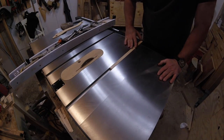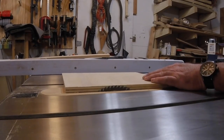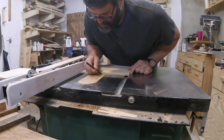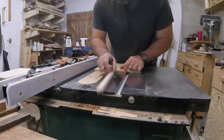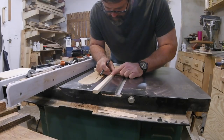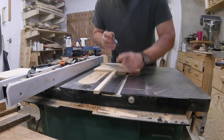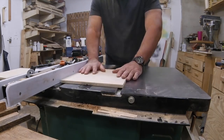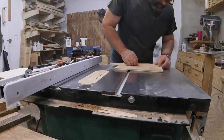For jigs that only use one runner, this is the way to go. I don't want to go to the trouble of setting up a dado blade just for one cut, so I'm going to use the blade I've got in the saw, which is a seven and a quarter inch plywood blade. I place the dado in a spot that will allow me to shave off just a little of the plywood so it will be zero clearance, and I mark the width of the runner to give me a rough idea of the width of the dado. I'm going to sneak up on it, but this will get me in the ballpark more quickly.